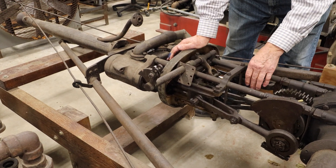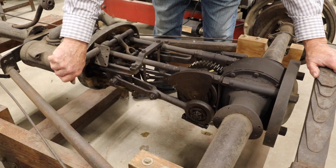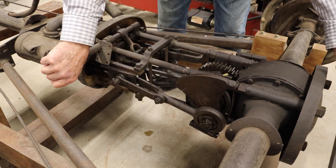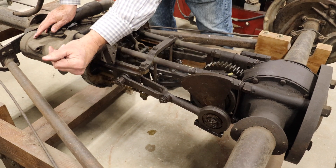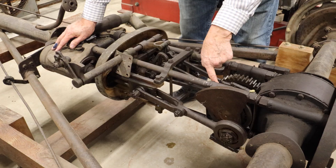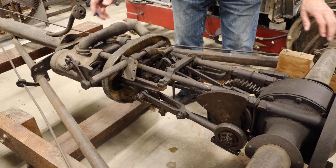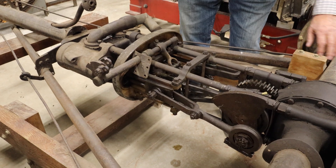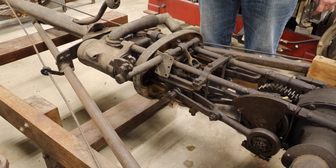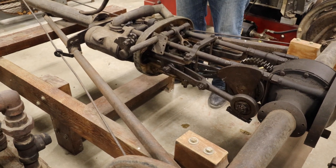Here we have two eccentrics which run two valve rods, and as you can see there's a sliding piece right in here that slides this back and forth. If you have a long lever on that it's very easy to move. These eccentrics are at 180 degrees with each other, so one set of eccentrics makes the whole engine turn this way; you slide them back so the other set does the pushing and it goes the other way. So you can go forwards and backwards without shifting gears, without a clutch, without anything — which is a real convenience, not very efficient, but quite a convenience.